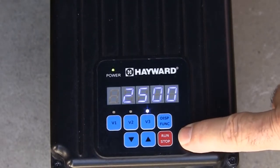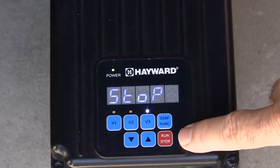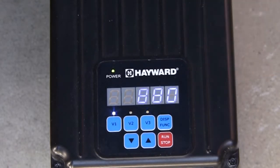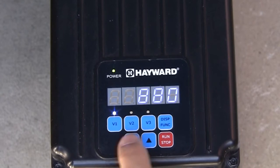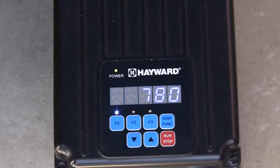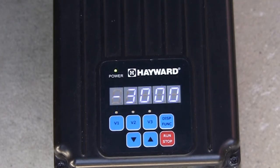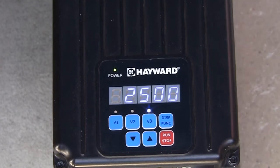When the run/stop button is pressed at any time during normal operation, stop will be displayed on the screen. The pump will come to a stop and remain stopped until the run/stop button is pressed again, at which point the pump will resume normal operation. To make a quick speed change to V1, V2, or V3 while running, press the up and down arrow buttons to increase or decrease the speed — the LED for the changed speed will begin to flash. To save the speed change, press both the up and down arrow buttons at the same time; the LED should now be solid. After prime mode, the pump will automatically go to V3 speed and time, then change to V1 after V3's time is complete. V2 can only be engaged by pressing the V2 button — the pump does not automatically switch to V2 at any time.